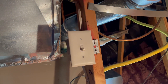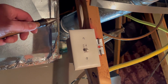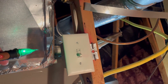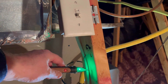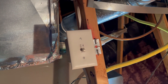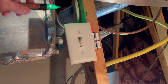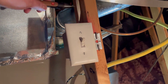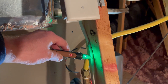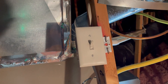Back up in the attic, standing next to the furnace. Switch is off. Going to check and make sure power's coming to the furnace. I turned that on at the circuit breaker — yep, circuit's good there. And it's still off down here, which it should be because the switch is off right here. So I'm going to turn on the switch and make sure I have power flowing through. Once I complete the circuit, I should be able to detect AC power up here and detect it down below. No AC power. Well, this might be a simpler problem than I thought. Hopefully the furnace doesn't have a problem — might just be this switch.